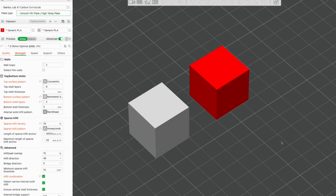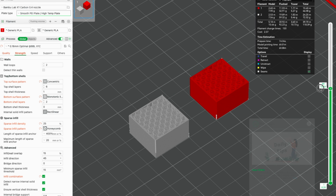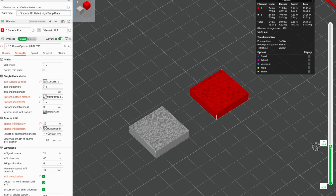Now it's time to move from your modeling program to your slicer software. When importing your models into your slicer program, remember to orient your models so that you can drop your magnets in vertically, and to make note of their relative location in the layer strata.